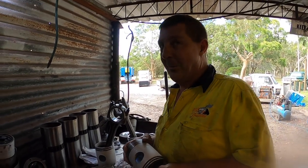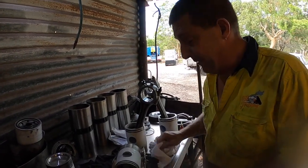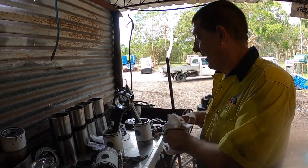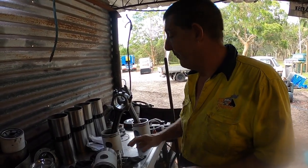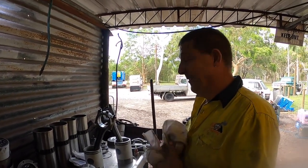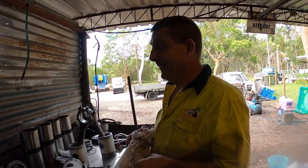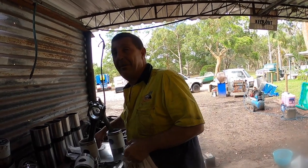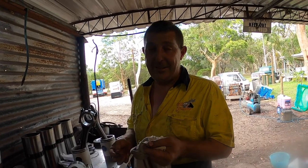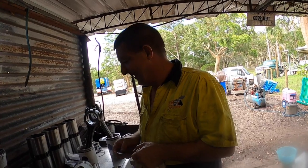It's gone well, yeah. But don't always assume that it is right. Make sure you do vacuum test them and do all of that, to confirm it. I haven't vacuum tested these two yet. So just do them all and then test them all at the end? Test them all at the end. When you buy pistons, they only give you two seals. If you cock it up, you can buy them individually. So they are available individually, and don't go thinking you're going to make some out of a bit of tin and drive it in there. It's got to be a perfectly nice machine.